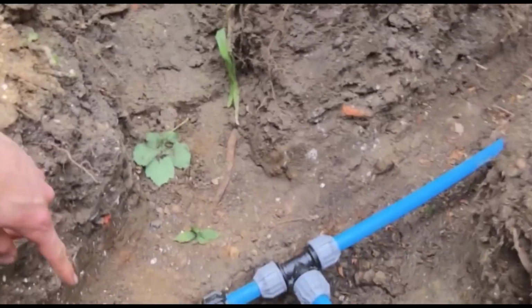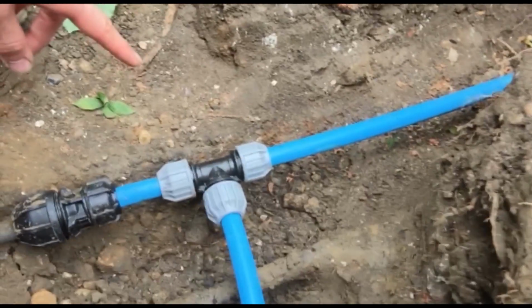So that's how it's going into the house. Originally it was just a lead pipe connected to the 20mm blue pipe there with another push fit coupling unit. But what I'm doing now is extending it out to our outhouse on a T-junction. In our borough, we're required to use at least 25mm blue pipe to put mains water in now. So I've gone for a 25mm, and it's extending about 30 metres all the way up to the outbuilding.